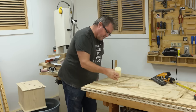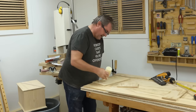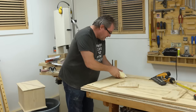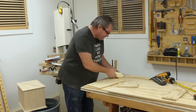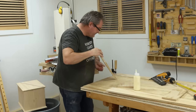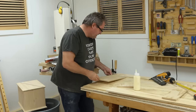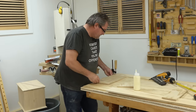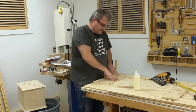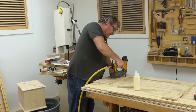Since all of my doors are going to be painted, it really doesn't matter. You'll never see the joint because it'll be glued up tight and I'll sand it nice and flush. I get some glue on there and on the end joint so those are joined together, line it up on the bottom since this is the bottom rail, and fire in a few brads.